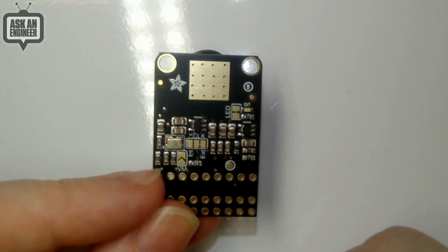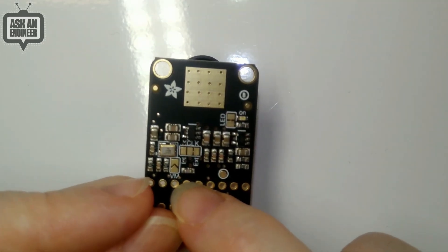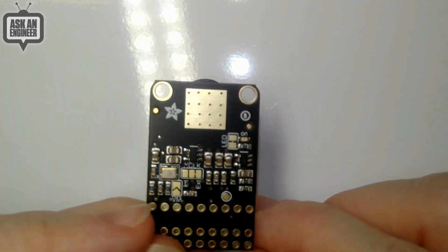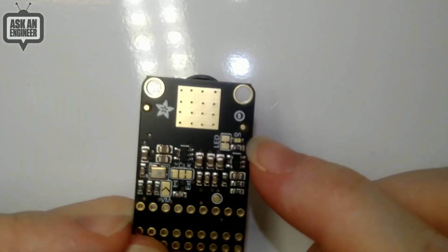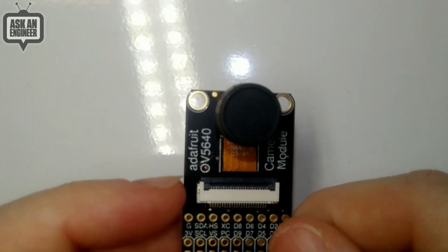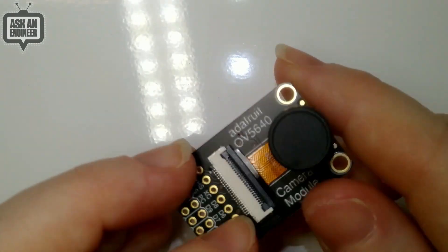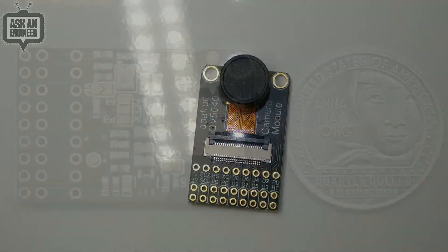Some OV2640s and OV5640s have a motor for autofocus. To enable that you connect the VM data-one pin to 3.3 volts — there's a jumper for that. Don't connect it by default in case your camera uses data-one as output, but if you're using a camera with motor control you can short that pin. There's also a power-good LED on the back and the strobe signal is brought out. It's otherwise the same pinout, shape, and mounting hole sizes as standard two-by-nine header camera modules, just with improvements. It's coming to the store soon — next week, with demo code.